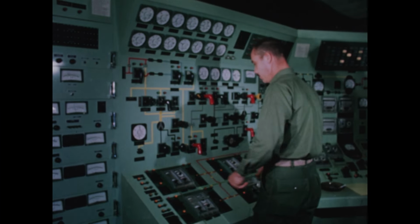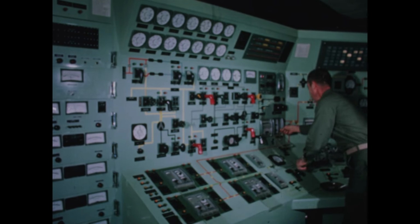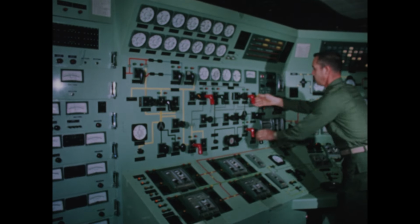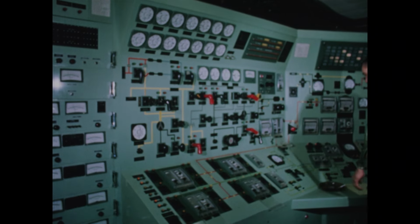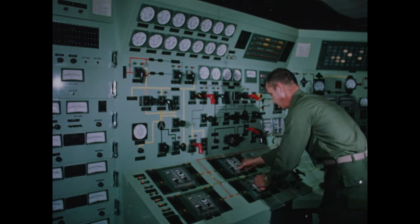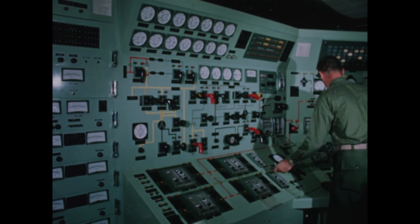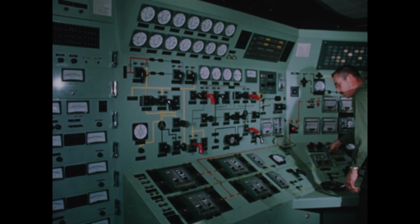Then rapidly secure condenser fans, close the superheater steam flow controller, close main steam stop, trip turbine throttle, open generator and exciter breaker, close condenser louvers, manually maintain level in the HTA package and the level in the steam generator.